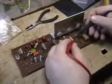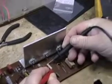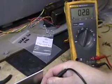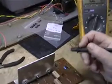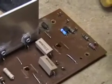You can find that in the power stage, for example, this 2.7 ohm resistor reads 2.8 — and after all these years it's in good shape. The ones you want to watch out for are these carbon composition resistors, because they break down internally when they are much older, and this board has got to be a good 40 years old.